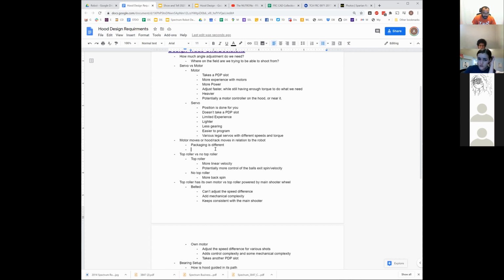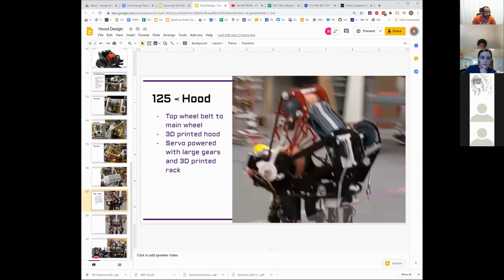If you need bigger gears, it definitely makes sense to have the rack move, probably. So the way the 125 setup works, if you did it the other way, it gets kind of awkward, because your internal mounting plates have to be so much bigger to hold the external gears and stuff, right? If we were to invert this to where the rack was stationary and the motors moved, these internal plates have to get really big to hold these servos and everything, which is not necessarily what you want.